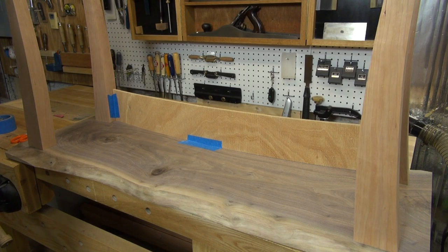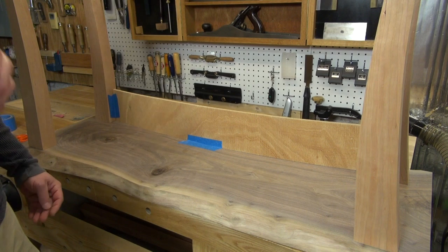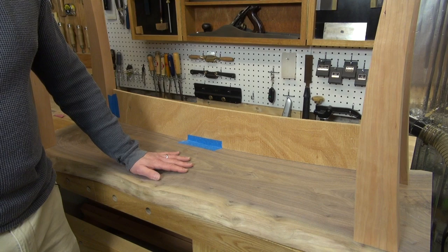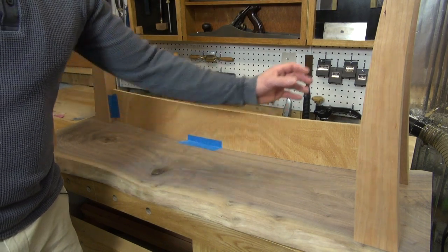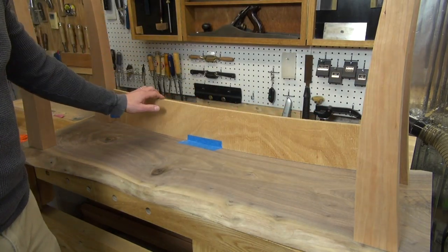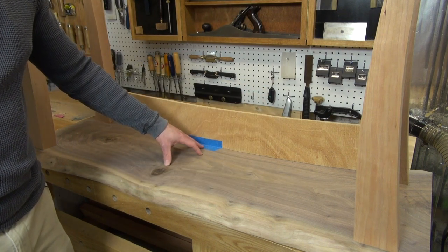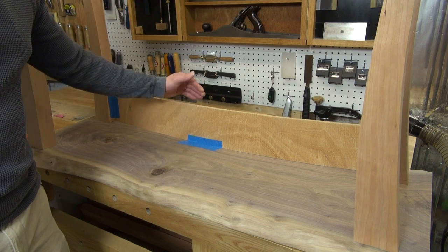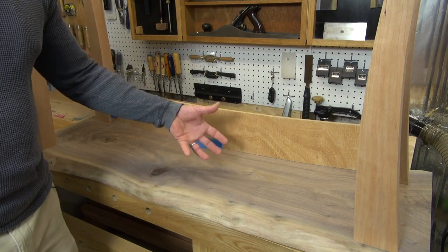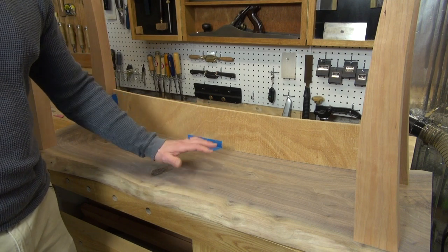Now because this project I'm sort of building on the fly, there's no real model or scale drawing that I'm working from. So I need to make sure that everything works visually with this set of proportions. What I've done is double stick taped the legs onto the bottom of the table top, and then I have this piece of bending ply that I've also taped between the legs and to the bottom of the table top. I've put a curve into this that matches the grain on the curve for the table top, and then I can flip this over and make sure that this shape and size works visually with the rest of the proportions of the table.